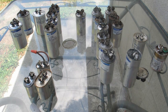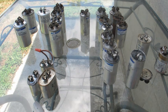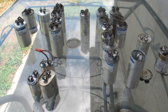Basically that's what a capacitor does. A run capacitor stays in the circuit the whole time the motor or compressor is running. A start capacitor is only in the circuit at the very initial start — once it starts, the capacitor drops out. But all these capacitors here stay in the circuit the whole time the motor is running.